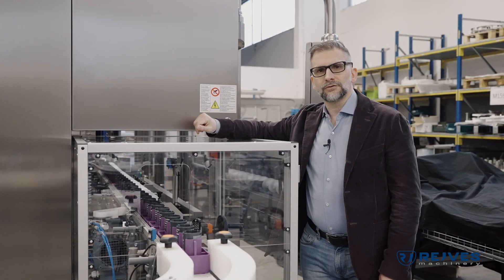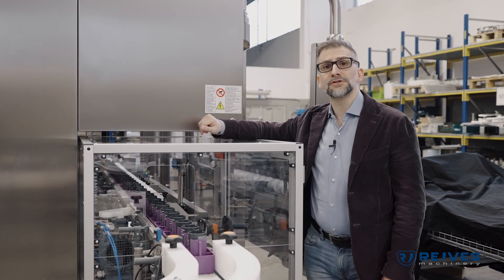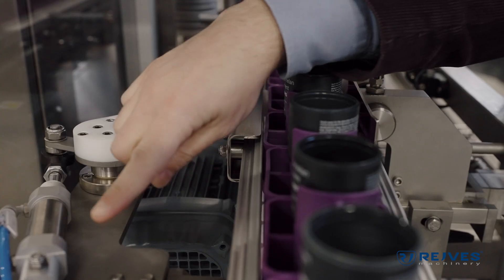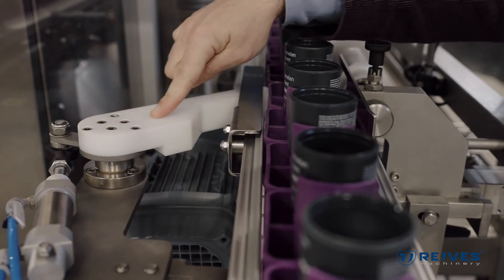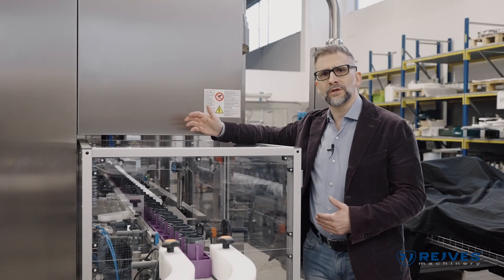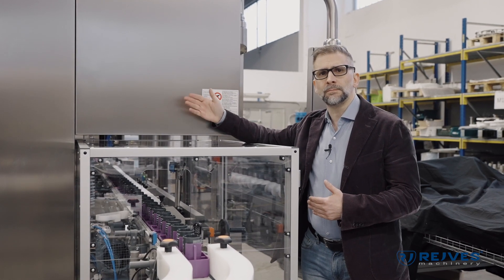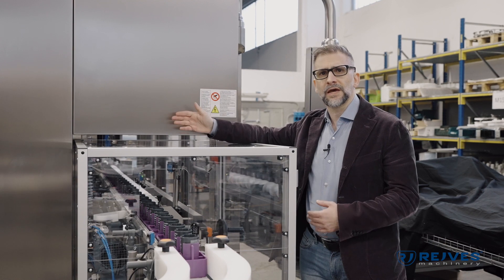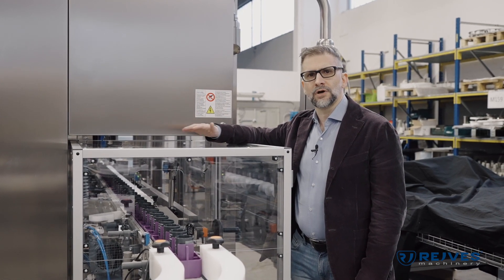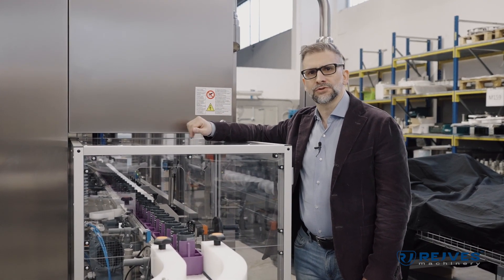Being a linear filler with a rotary hybrid turret controlled by servo motor, the first feature of the machine is the infeed block for the bottles. This means that we can control the feed of the bottles and whenever we have a malfunction of any sort inside of the machine, we can jump the nozzle or the capping turret accordingly so that you can run the production seamlessly without any concern.